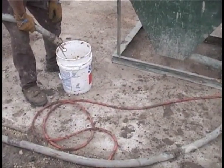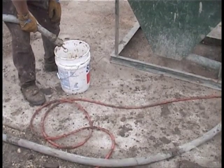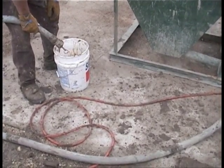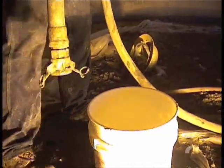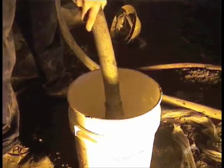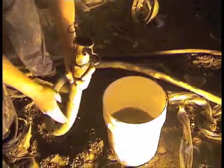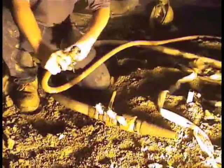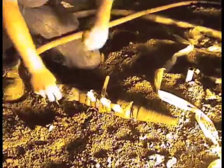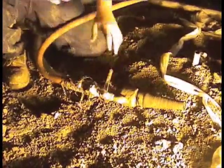The primer is just about out now. Okay, the mud is getting to the end — we shut it off. What Michael is doing now is cleaning the end of this hose, washing it out so that he can put the nozzle on and get a good clean clamp. That way you don't have problems when you start to spray. There, the nozzle is on now — clamp that down in place. Now to add the air to it. As soon as he gets the air hooked up, the nozzle is ready to go.